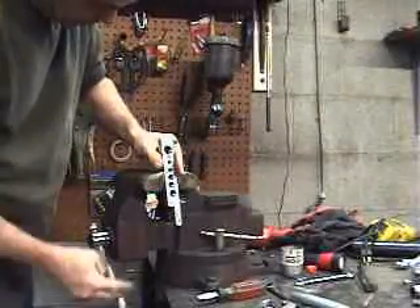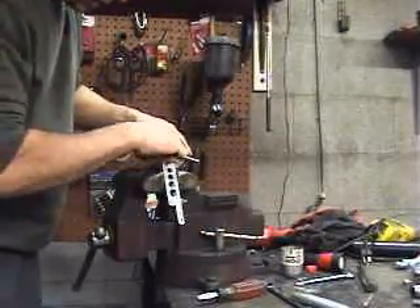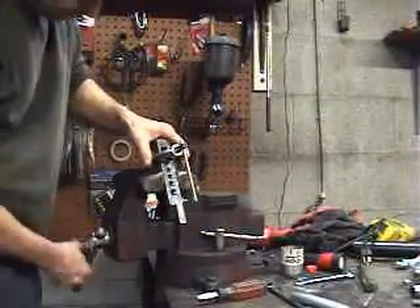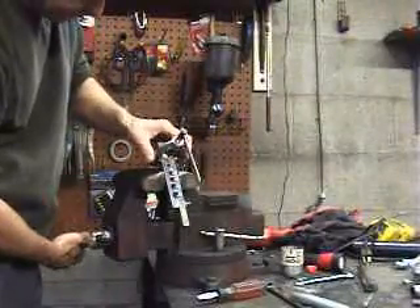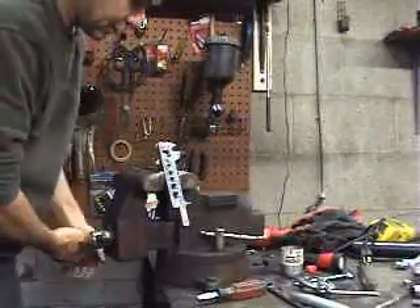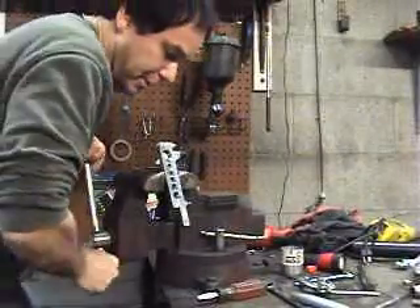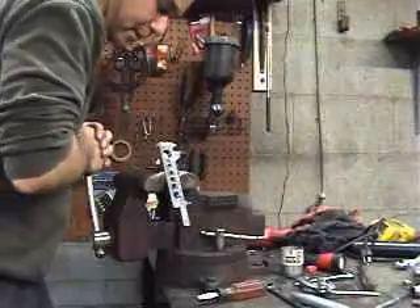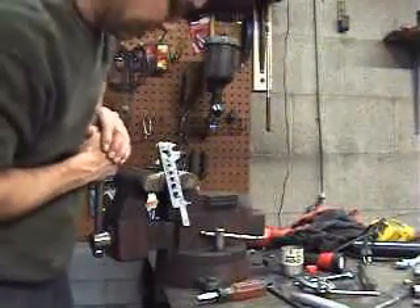What I do is I stick it in the vise and get as close as I can to where I can still fit this in the position I need it, and snug the vise down. That helps it grab a hold of this tubing a little better, because when you go to swelling that tubing out and making the flare, you don't want to push it through — this thing doesn't grip it as good as it should.